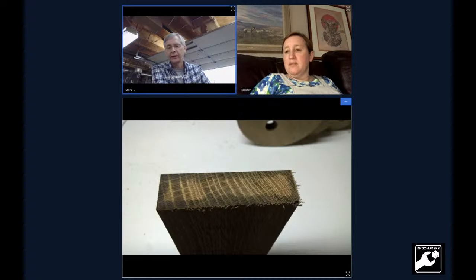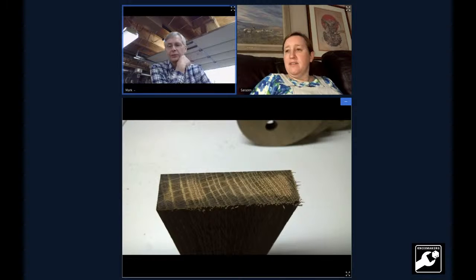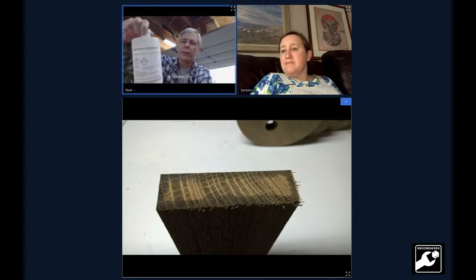That would be handy if you wanted to change the color and still be able to work on the wood. You can sand it back down or whatever and it'll stay the same color. How do you get the ammonia on the wood — is this gaseous? You put it in that chamber and it evaporates into gas and it darkens the wood — that took about six days. Household ammonia will work, but not so good. What I use is ammonium hydroxide, 28%.